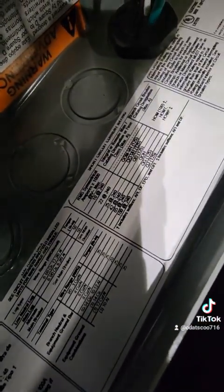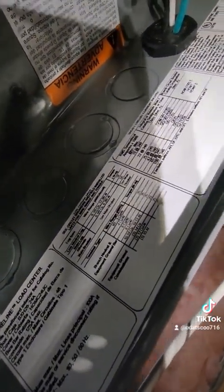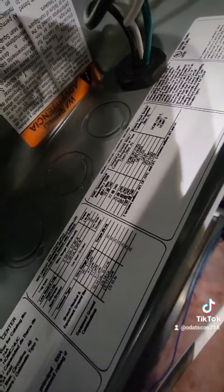I'm about to drop my brand new screwdriver! So the new NEC code is that the breakers, all these lug nuts, everything has to be torqued down to the manufacturer's specifications. You can see right here it tells you what they need to be at. I can't really read it but it's usually 33 or 25 inch-pounds of torque. I'll box it up and show you guys.